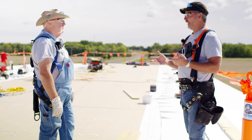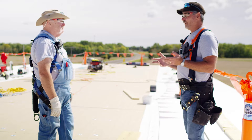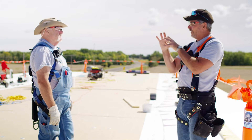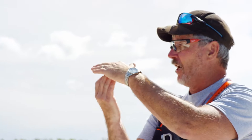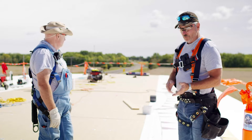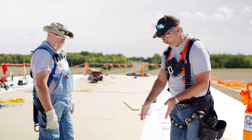I've seen cases where six, seven, eight-year-old roofs done by experienced guys had this issue — over time the membrane curled under there, got so stiff it actually started cutting from the underside of the membrane. So yes, that very well could happen. What we had to do here was cut off maybe six inches from the sheet.